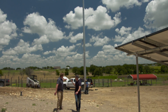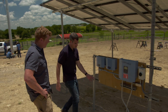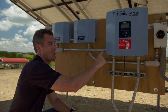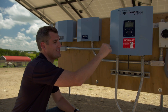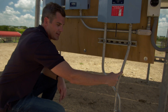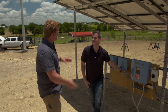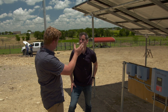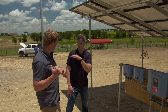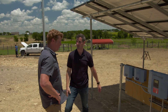We've got a wire at the base of that tower and it runs underground — two of them. It comes in on this conduit right here and feeds into our inverter. We also have solar power coming into our inverter. Both are DC power and they get converted here to AC power, which feeds out through this conduit to our house and barn. When we need power in the house, it will first draw from this system — either solar, wind, or both. If we need more power than we generate, it grabs it from the grid. And if we generate more than we need, our meter spins backwards and we feed the grid so our neighbors get to use some clean electricity.